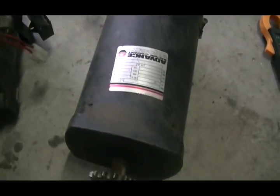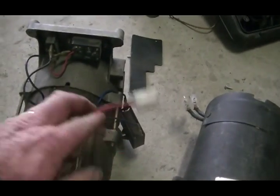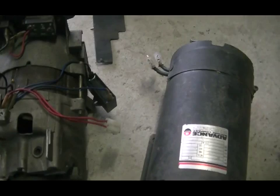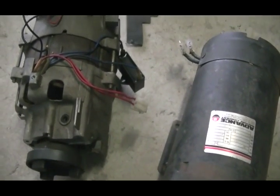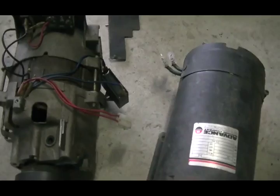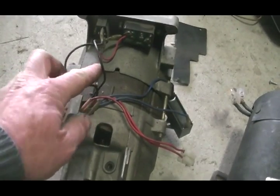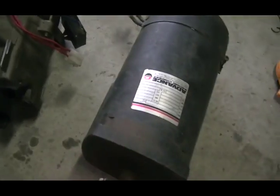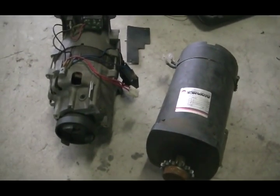The first thing I'll have to do is knock up a frame and couple these two together. We'll plug some power straight into the motor and put a load on the AC side of the generator, just to see what we can get in and out as a standard system. Then we'll start playing around with shifting phases on the motor to the generator, and also see if we can run current through the generator's 12-volt coil to get a motor effect out of that to take some load off. So we'll go ahead, knock up a frame, and come back for part two.